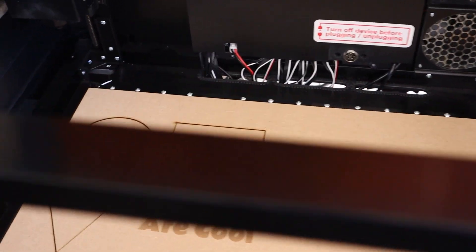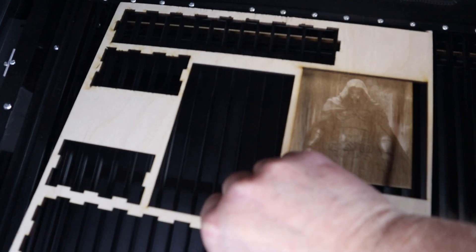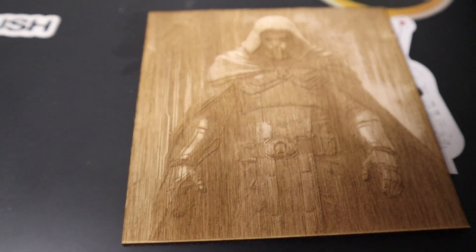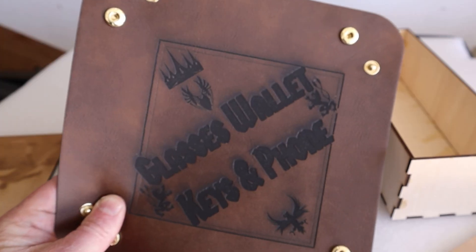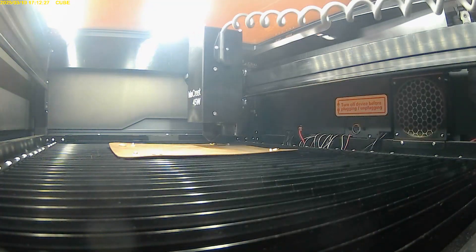Over the month that I've had the machine, I've run quite a few tests, and I want to share some of these with you now. I don't like doing big extravagant projects for this. I like running a lot of the typical things I would use to test a machine to gauge whether or not I want to use it in the future — doing simple engraving, doing some box making to see how accurate the kerf is, and also testing out some of the capabilities of the camera. One of the biggest adjustments with using this laser is the power. Because it is a more powerful laser at 45 watts, the power should be turned way down.